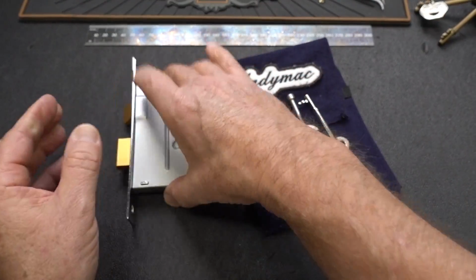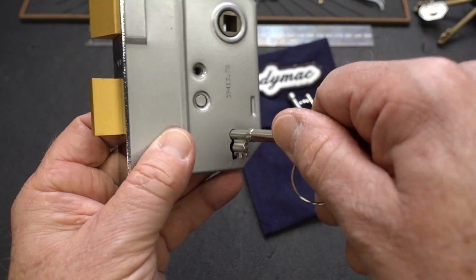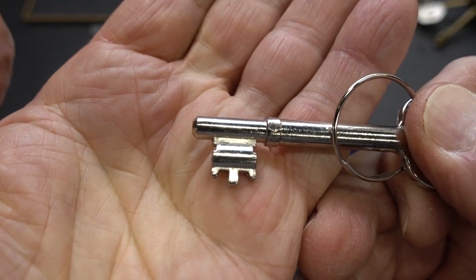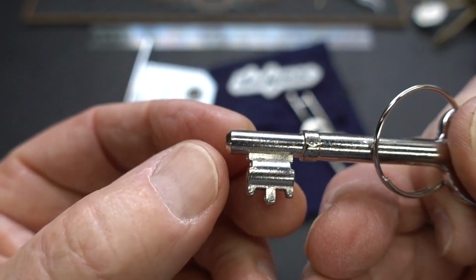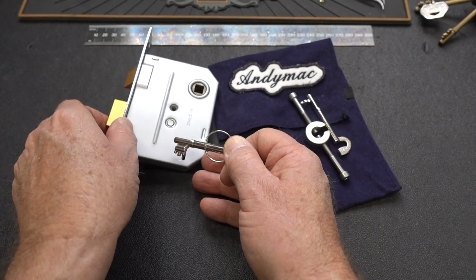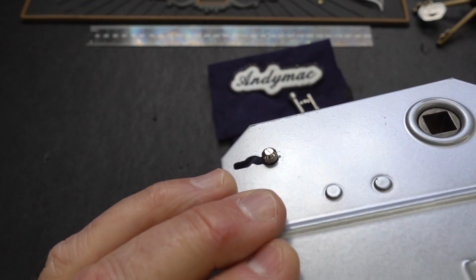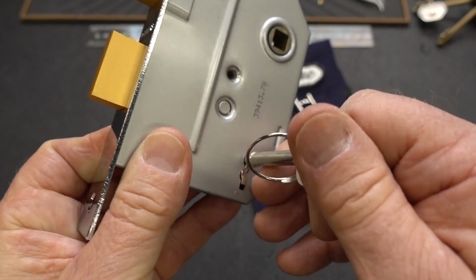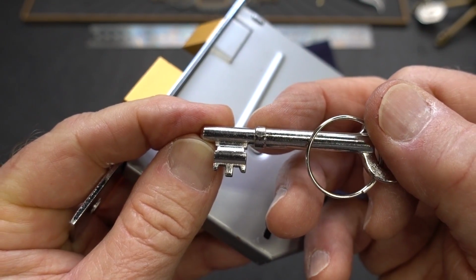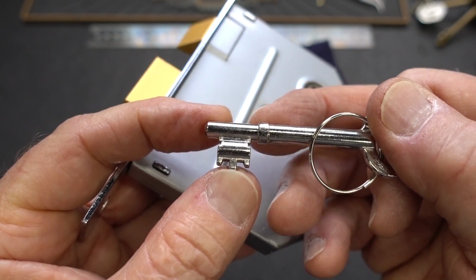Well, we're going to take the key. Now, the key obviously does everything that I just showed you, but without all the drama. Easy unlock. Most of these keys, you can see a couple things about this. First of all, the tip of the key extends past the last cut. The reason it does that is so that when it goes through the keyway, on the other side, it sticks into the hole to keep it perfectly aligned so that key is not going to be flopping around. The other thing about the key is we have a stop right here, so we don't shove the key in too far. If we shove it in too far or not enough, those cuts are not going to align with those levers. So 2 important characteristics.